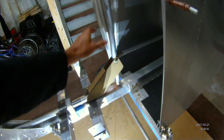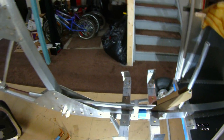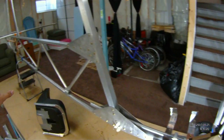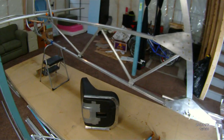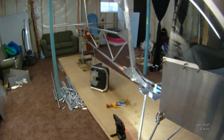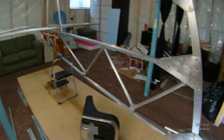Get this mounted with a bearing — this is all just mock-up stuff: cheap aluminum from a hardware store and cardboard. It all has to get changed into T6 6061 aluminum. Then we'll start on the brakes, order a bunch of parts from Aircraft Spruce, finish off the bell crank back here, and get the wings started, hopefully before Christmas. Video number nine — I hope this helps somebody. It's snowing like crazy outside, day off work — it's build time. Let's go.